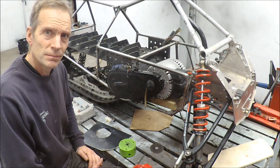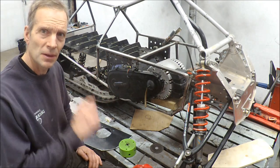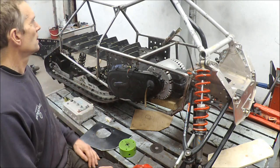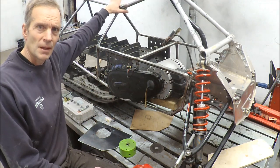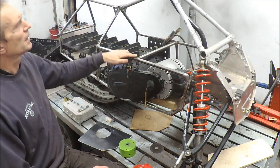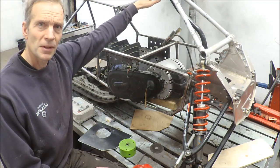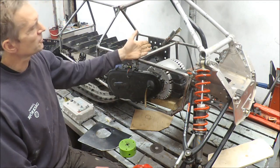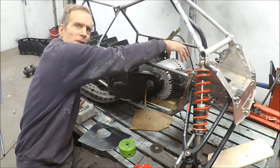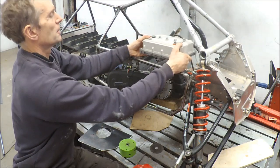In winter, if there's quite a heavy load to drive, I will have approximately half an hour of ride with the batteries I will use. So what I will do is remove this framework for the seating. I will have a totally flat area from here, and I will remake this support for the steering column, building a box to fit the batteries on the other side of the motor and the controller on top.